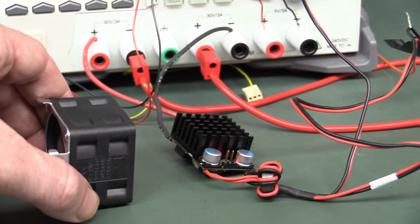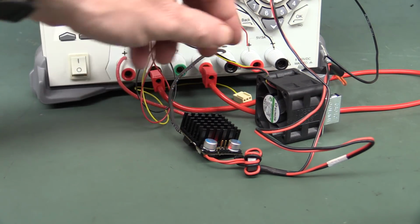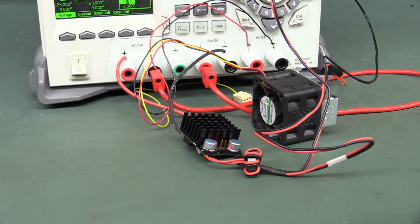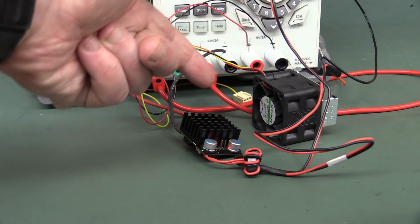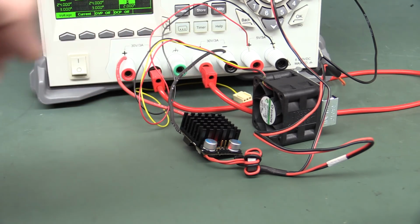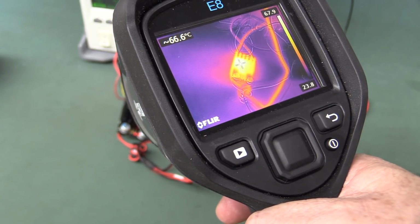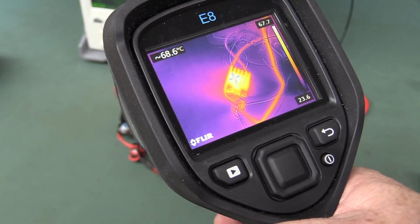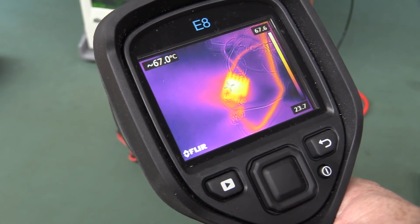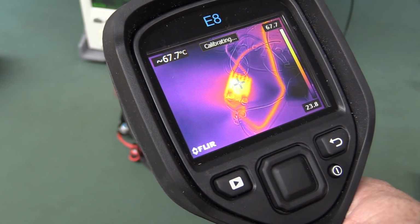So what I'm going to do is, because the whole idea was just to do the heatsink, I'll flip it on that side where the board is down and see if it increases. I probably would expect it to increase a little bit when there's now no airflow on the bottom. It's only over the parts, which is certainly going to help, but just over the heatsink. So let's have a look at that now. I've had it going there for a while, and that's actually rather surprising. I'm getting under 70. Now, I would have expected that to increase, but I guess it's angled differently now over the fins, so I guess it's more efficient.